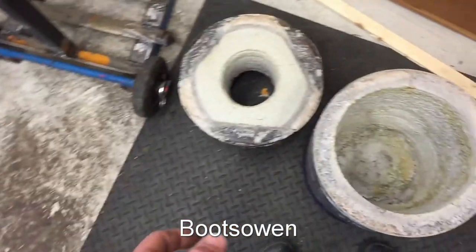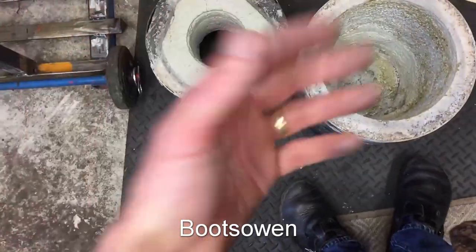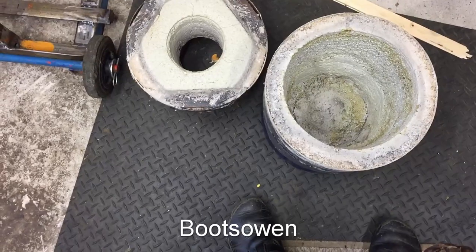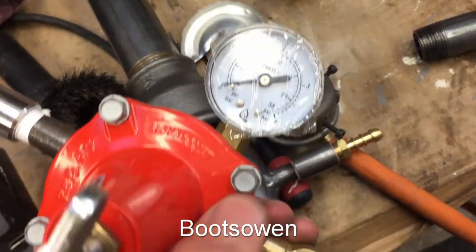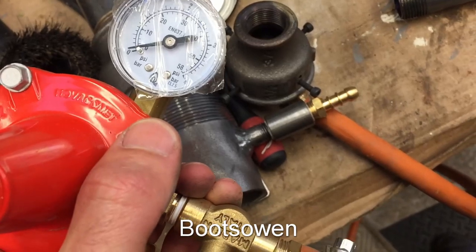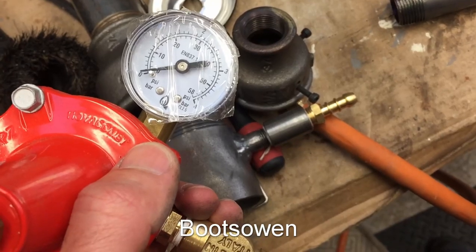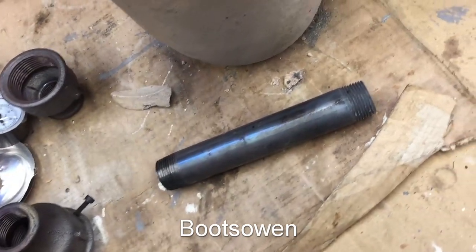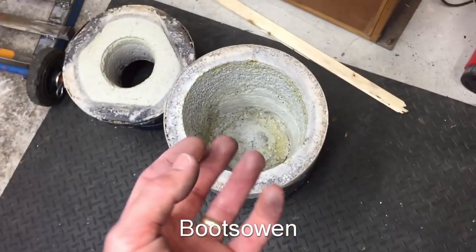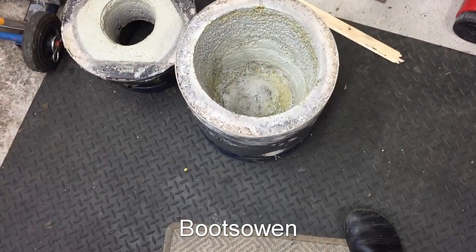And the other thing I did then was I put the aerated porcelain brick, insulating fire brick, on top to choke the exhaust gas once it was getting warm, and took it off at the end. And it seemed that with the gauge on the regulator, I was running it by pressure. So I started off at around 12 and then opened it up to 20. I think you can go even higher, but I didn't want to overheat the thing in case there was any moisture in it that burned and exploded and damaged it. But it seemed that there wasn't, and it did the job just nicely.